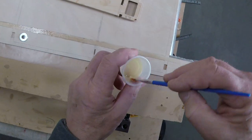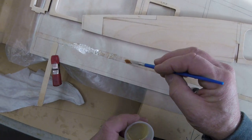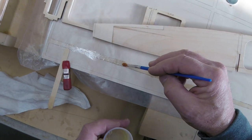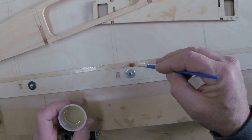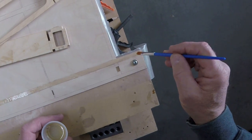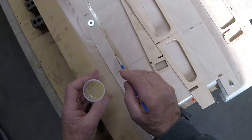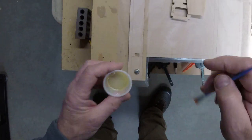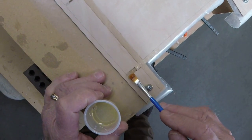By the time I came back out, the sun had moved, ruining our image again. At some point I was talking about why I'm wetting this out before throwing the thickened epoxy at it. A couple of reasons: number one, a thickened epoxy will tend to just stand up on the wood and might not really bite down well into the grain. Number two, even if it's not sticking well in a given area, I want there to have been epoxy there — you don't want the spot to be dry. If it is dry, water will soak in and you will see it later as dark streaks in your wood where the water is traveling up the grain. Makes you look like a bad builder — don't be a bad builder.